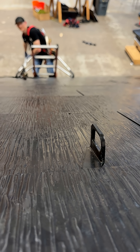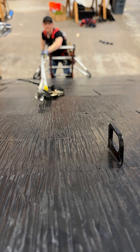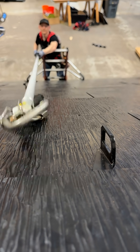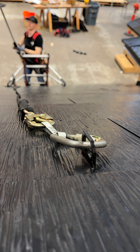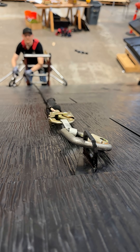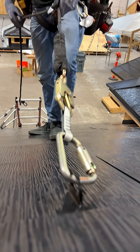When making initial connections to the assisted access point of a completed solar roof, consider using a telescoping pole with a carabiner holder and a rope sling attached to the end. With a rope in place, ascending the roof is much safer and allows for temporary connection until a working anchor is installed on a rafter.